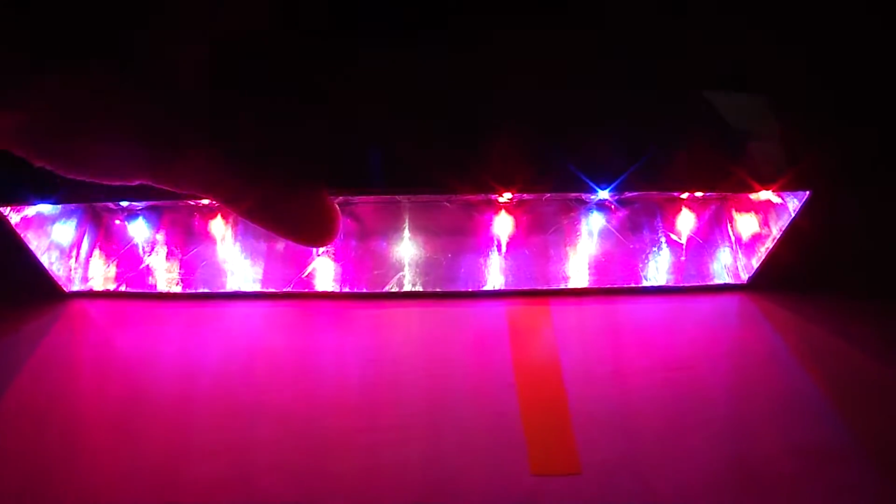And going back to the reason we're using a spinner on this, it's easier for us to build a spinner than to build the LED array in a smaller format than what we have already in our testing. And that goes back to what I said earlier: if we built a 300 watt LED fixture, it would actually be 900 watts total outputtable power, but it would only drive 300 watts at a time, in different segments, so you wouldn't have total shadowing, you'd get your total watt output, and your plants would be happy.